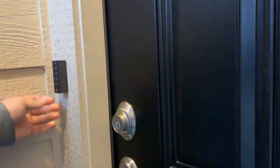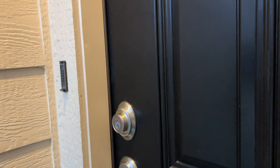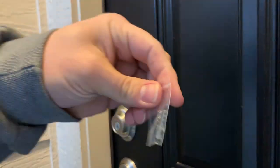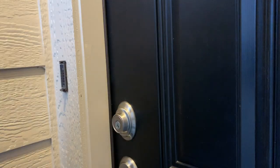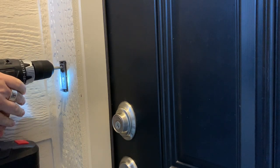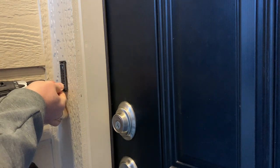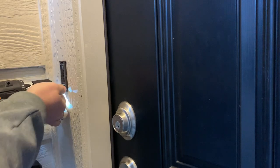Then I want to take the keypad off and actually leave the back panel stuck to the frame. Next, I'll go ahead and take my screws — not going to use the anchors in this particular situation. I'll take those screws and screw them in through where the two circles were: one where the oval is, one where the circle is. What that's going to do is secure that back cover to the door frame itself, give the keypad a lot more stability, and really keep it from falling off should the adhesive ever become not sticky.